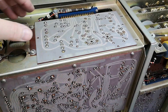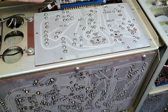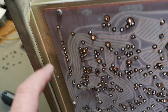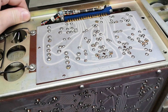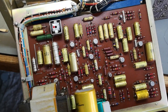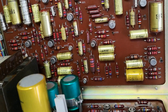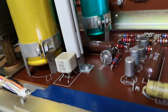I was trying to unscrew the power supply PCB to take it out but I can't because the large capacitors won't let me pull out the PCB. But then I realized this whole unit is mounted on a hinge. There were two screws here and two screws here - I took them out and what do you know, this whole unit you can just take it down like that and then access the entire power supply while it's still connected and you can measure what is going on. And that will be the rectifier - wow, that is a really cute one.